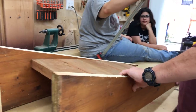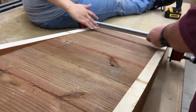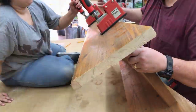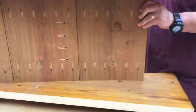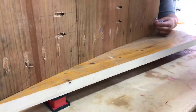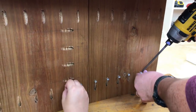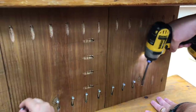Now I've got to put on the other side. I'm not really trying to make anything perfect or measure the height or get it square or level — I'm just going to clamp it and screw the other side together. One of the biggest advantages of pocket holes is that they're fast. This whole project might have 40 or 50 pocket screws in it, and the whole thing was drilled, put together, and assembled in maybe 30 minutes. That's a huge time savings over traditional joinery, so for me, if my project is utilitarian, pocket screws are really the way to go.